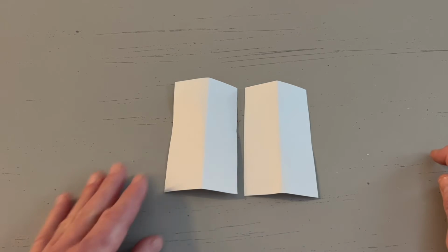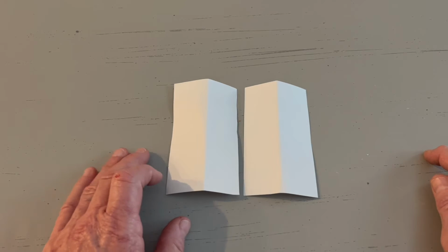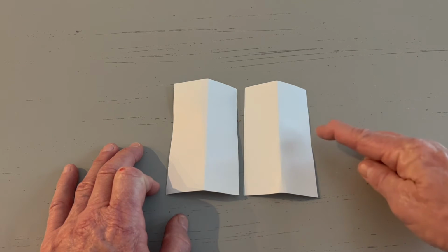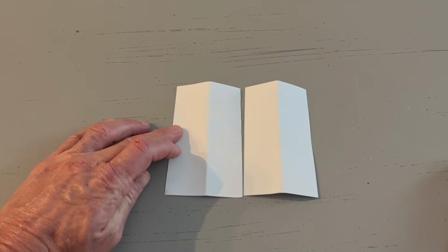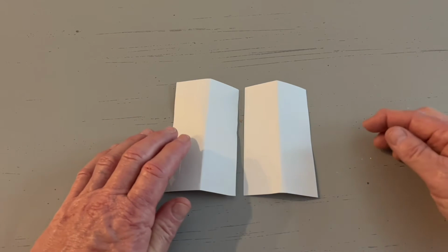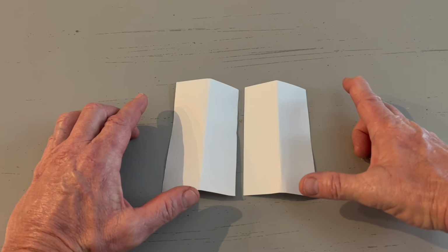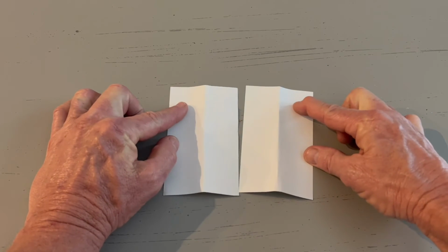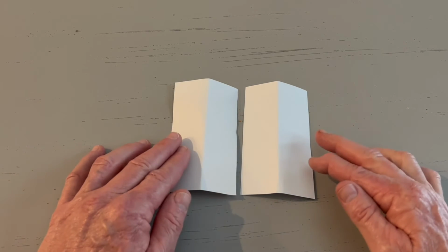And now maybe it's still not perfect, or maybe you just went a little too far. And now you have no more gap over here against the jamb. You can't move this door in any way. And this is what your gap looks like. So you take this door and you just move it like that. So you manipulate the bottoms. You can lift these things up and move the bottom corners side to side, and you can loosen those screws and move the top corners side to side. So try to manipulate them however you can to get them working well.